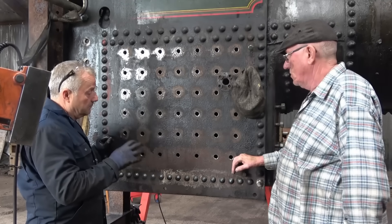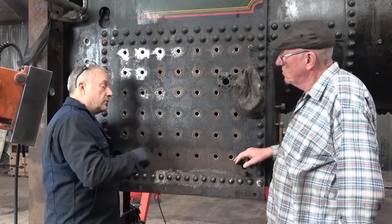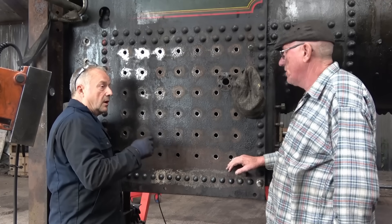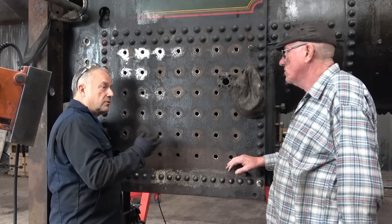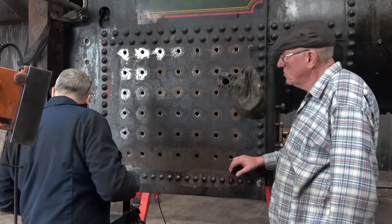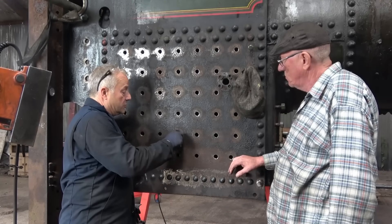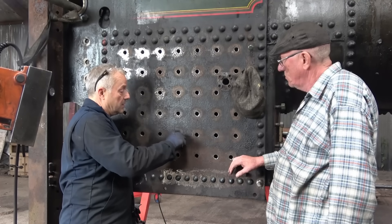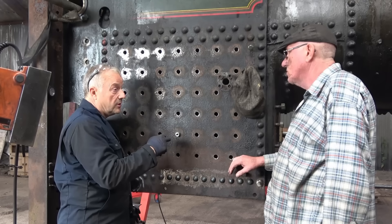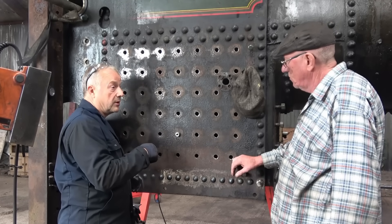I've got a bit of a problem that I've got to rectify. The new firebox inside, obviously it's virgin steel. So I'm going through these with a 22mm drill. Obviously I can't go straight into a 22mm drill in virgin steel - you've got to put a pilot in. So I need to put a pilot there. I've made this little centering guide - I'm going to just roll that up into there. That will serve to centre my pilot drill. Then we'll take that out, swap it for the bigger drill, and go through with the bigger drill.